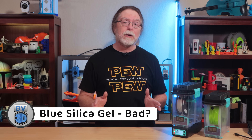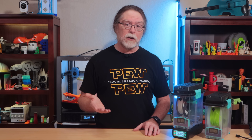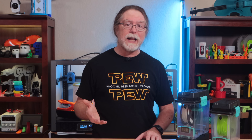I need to mention that there's some concern about the blue indicating silica gel that comes with the PolyDryer boxes. That's the silica gel that's blue when dry and turns pink as it picks up moisture. The blue color is provided by a small amount of cobalt chloride, a toxic and/or carcinogenic chemical. From what I've read, the amount of cobalt is between 0.5% and 1% of the weight of the silica gel. The orange indicating silica gel seems to be the recommended alternative, and I found a one-pound bag on Amazon for about $8. Is the blue indicating silica gel something to worry about, or do you think it's reasonably safe in this application assuming you're careful with it? Let me know down in the comments.